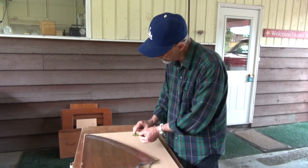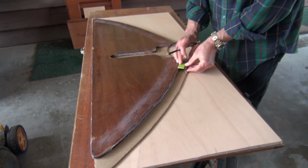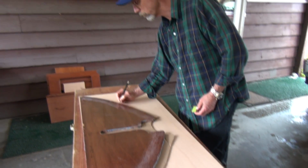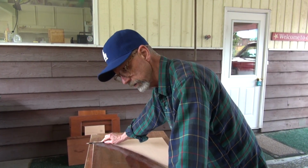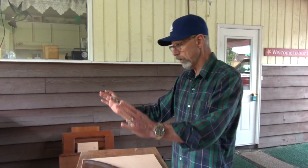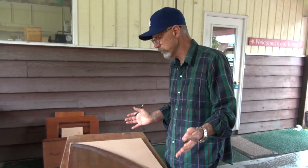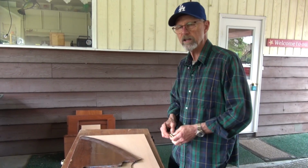And if you look over here, you'll see this side you've got 1 inch or so, and over on this side, in places down here, it comes right down, almost to the very bottom, almost to the edge, but it's never even as much as half as much of a distance as it is over here. And yet, when we put it in the boat, these are centered. This curvature here is different. And remember, we're moving it back 4 inches, so the whole design of the hull flares out slightly and gets more belly to it as you move aft, more tumble home on the outside. So there's more curvature as you move aft. You move even 4 inches, the curve changes, everything changes. So anyway, we make a new pattern, and that's how we do it.